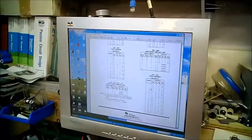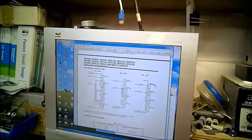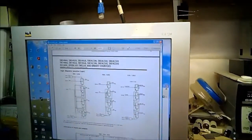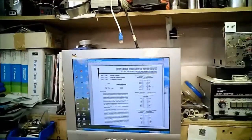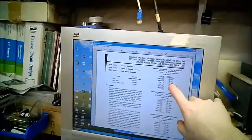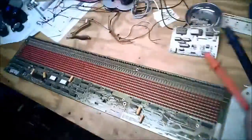2D. Pin 12. What's on pin 13? Oh, no connect. Okay. So basically, this input and that output's not used. This is the most significant bit. He's used to feed the shift clock into the UART, and these two guys are probably unused because they don't need that frequency divider.